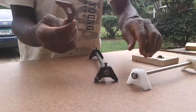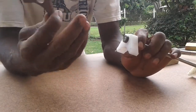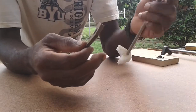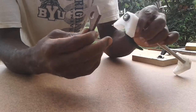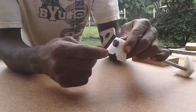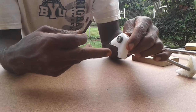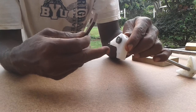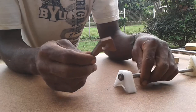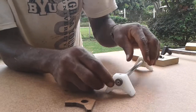Then I use a piece of cutting board that I have that I never use. It's just a big 24 by 24 block of it, and I cut a little strip off, and with my template I trace it on there. Took it to the bandsaw and do the same process. Then I took it over to the router table and get this shape on it.